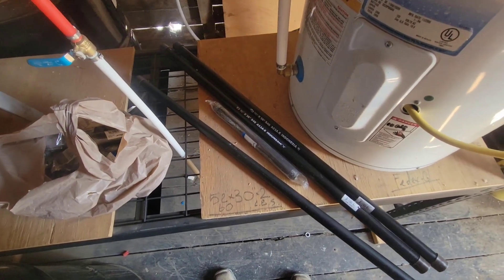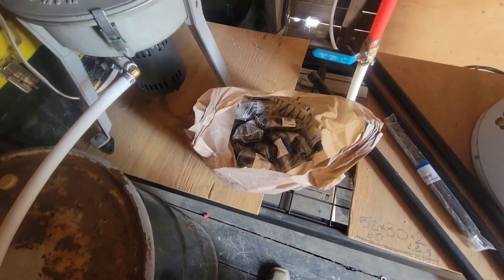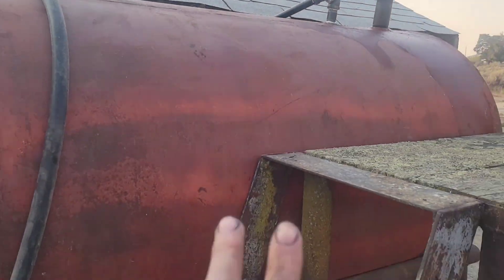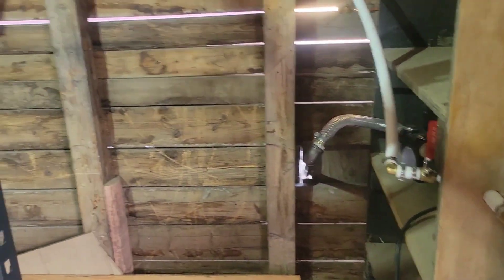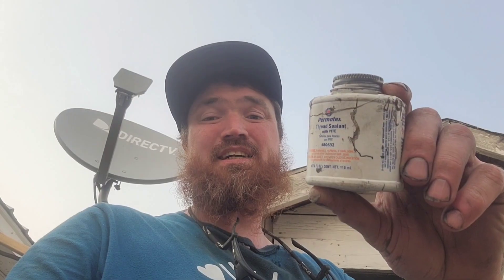Man, I want to make my first batch. I am getting excited. Instead, I'm spending my weekend running to Home Depot for some black iron pipes and black iron fittings to replace that galvanized stuff. I've now switched it out to black iron pipes instead of galvanized. I also switched out up here and made my own little vent so that we don't get airlock in the tank. And I switched out over here to black iron as well — got all my fittings reconnected to those pipes coming in through my walls, got them all pipe doped up. Unfortunately, with the pipe dope taking 24 hours to cure, I can't run my first batch for this Sunday's video.